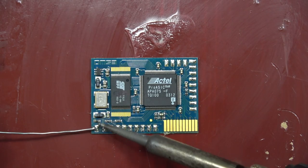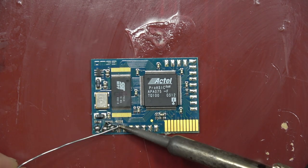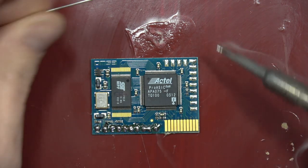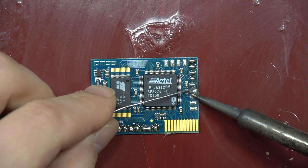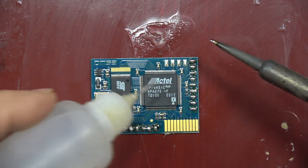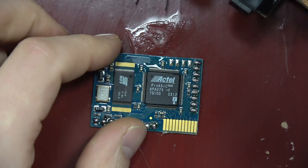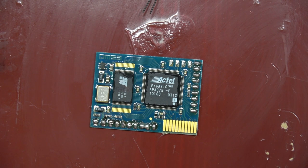All this old solder wouldn't have been good if I ever wanted to install this chip into another PlayStation — I'd want to remove it anyway. This chip came out in 2003, so it's like 15-year-old solder. The technique is: add new solder and flux, then remove the new solder — it mixes with the old solder and pulls it off. That's how I do it.